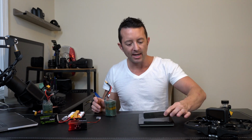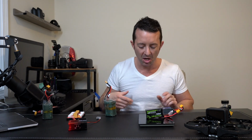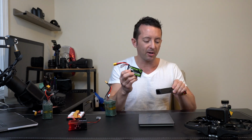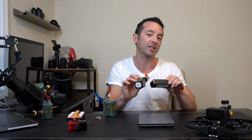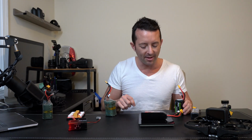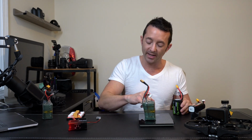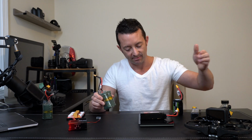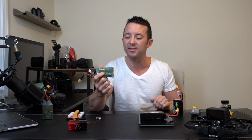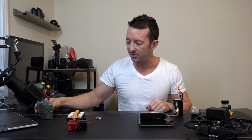So we have our standard 1800, 200 grams. Let's see if this one's the same size for the same thing. 195, so this one's slightly lighter than this one somehow, and has slightly better amp output according to the little sticker here, right? And then we have this one, this is 2200 milliamps, 237 grams, and 308. Ooh, almost 70 grams different for a 21700 of the P42's 4 amp hours or 4,000 milliamps, okay?